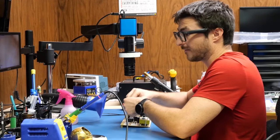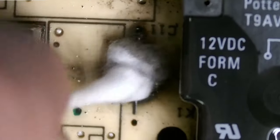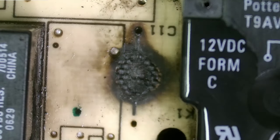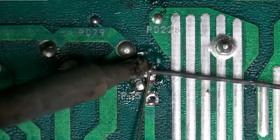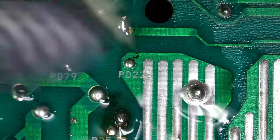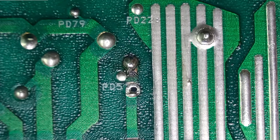Before I install our replacement, I am going to do a little cleanup. I just want to get rid of some of the charring — it can be conductive, or at least that's what I've heard. I just want to make sure we're not going to get any shorts to any other components nearby, which I don't think we would. And that should be good enough. Now we'll put some fresh solder, cut off the leads, and clean up some of the flux. With the desoldering wick, I did actually remove a little bit of the solder that was here, but that's not going to make a difference. So we'll leave it as is.